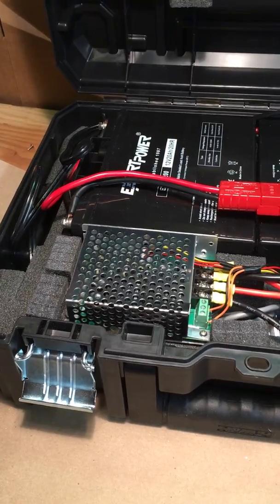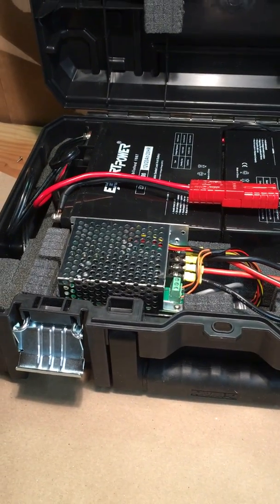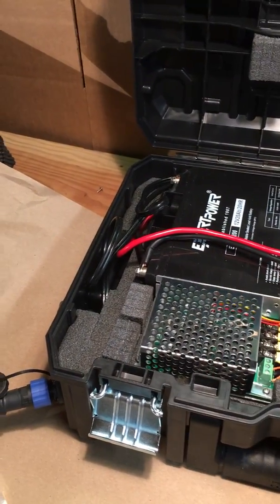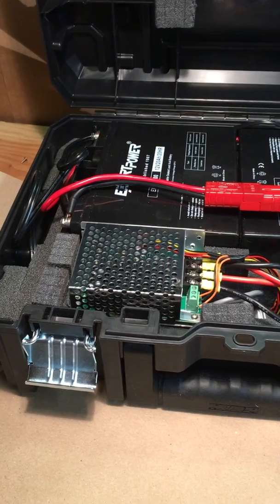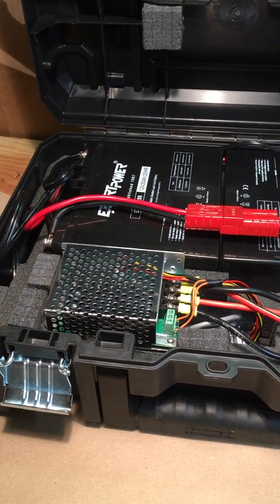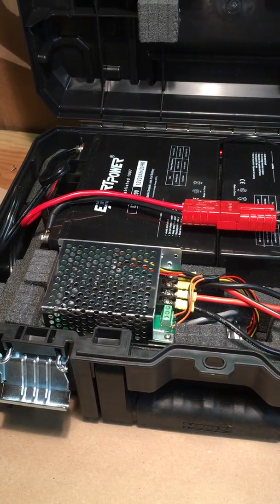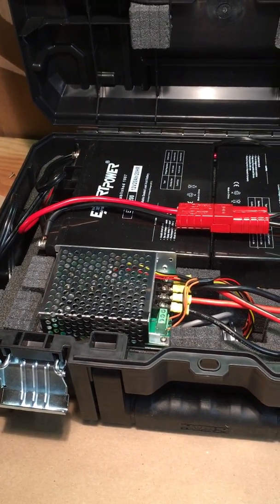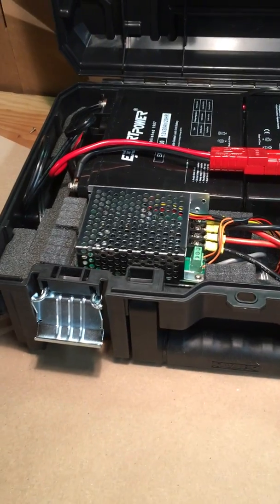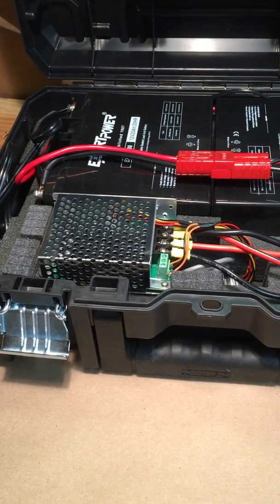This is a speed control unit. It is called a PWM, which stands for Pulse Width Modulator. Basically what it does is you connect it to the batteries, and via this knob and the internal circuitry, it will turn the power on and off at different speeds. Let's say your full speed, or the highest voltage, is 12 volts. Then you turn it off at 0. If you average that out over, let's say, a millisecond, the average is 6 volts, because the top is 12, the bottom 0, the average is 6. So in that span of time, you're only feeding the trolling motor 6 volts. Now this happens thousands of times a second.